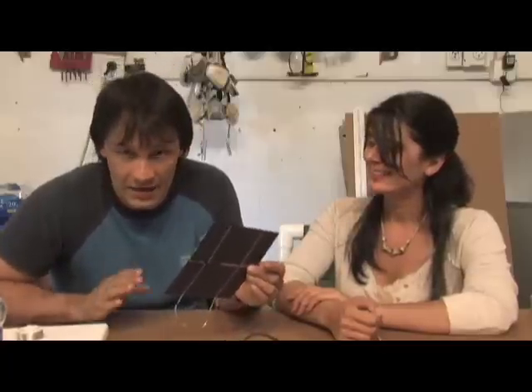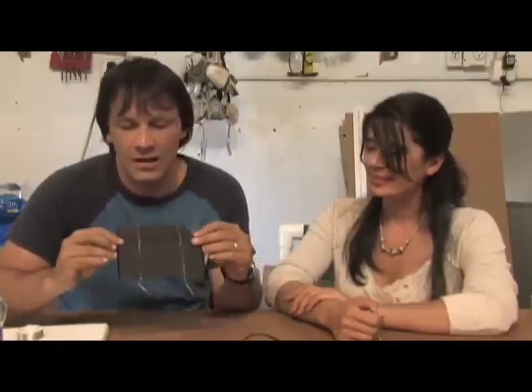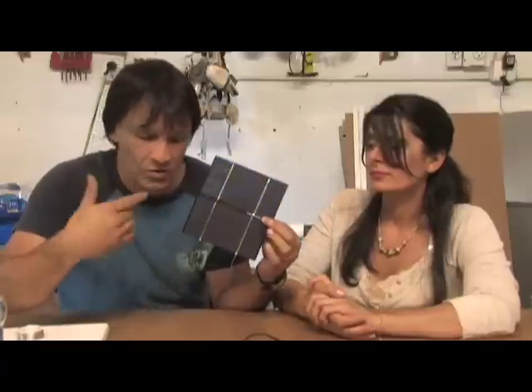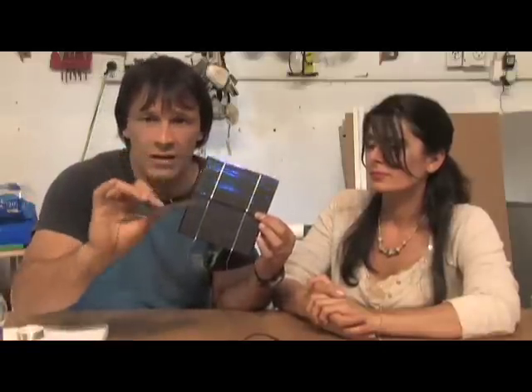Yeah, it's definitely a practice thing. Our soldering iron is not a good soldering iron for this — you want to buy a good one that gets a really good heat buildup to it, and it'll be a lot easier. To charge a 12-volt battery, you would need 36 of these to get to 18 volts, or if you wanted 20 volts you'd need 40 of these. What people usually do is they'll do 18 of these and then 18 more, then tie those together so that jumps the voltage up. 36 of these would produce about 60 to 65 watts. The Harbor Freight system we have outside is 45 watts, so if you put 36 of these together you'd have a more powerful system. It would cost you probably about $100 to do that with these cells and the tabbing wire — but you have to take into account that you're going to break some along the way.